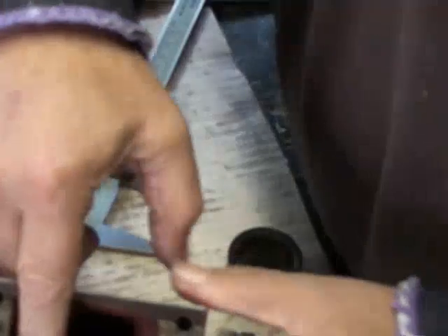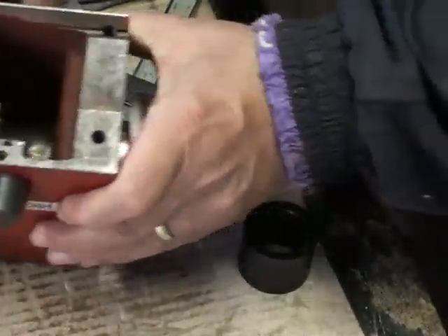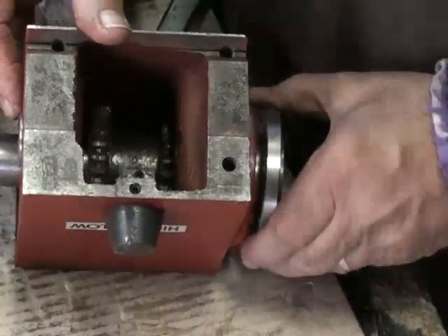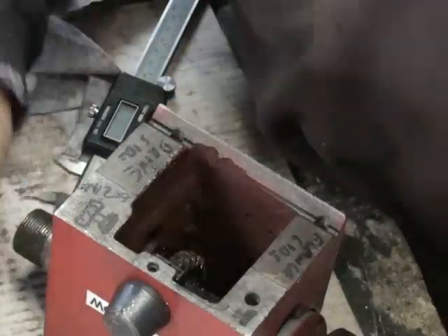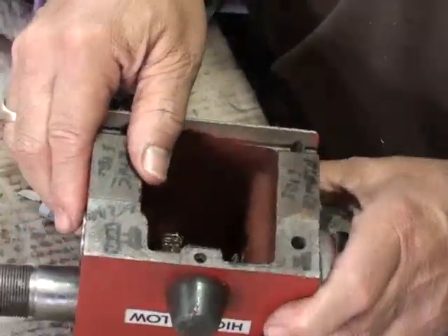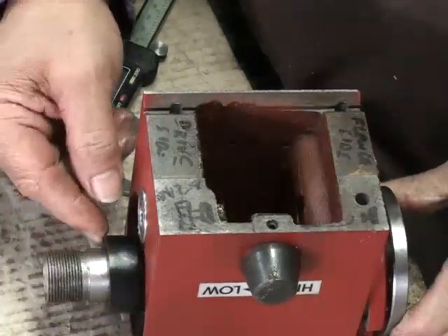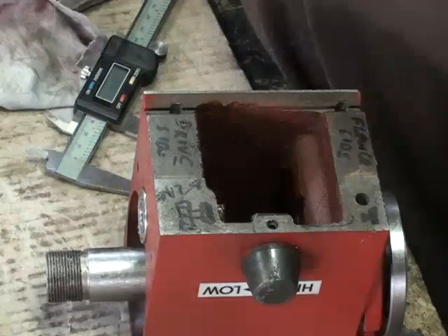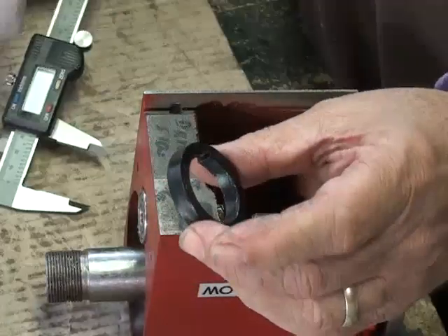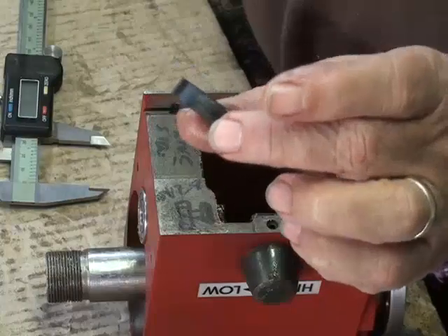I've now put the metal gear inside the casing, as you can see there on the shaft — lined the keyway up. The next step is to take 0.1 of an inch off the spacer which goes on the outside, because the new bearings are a little bit fatter. I've also got to trim this particular spacer back — take a small amount off so that it fits inside the cage of the taper bearing, just like I did on the other side. I'm going to do that now on the lathe.